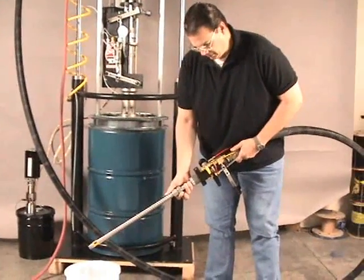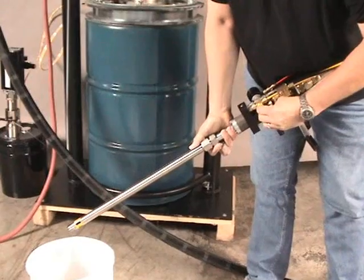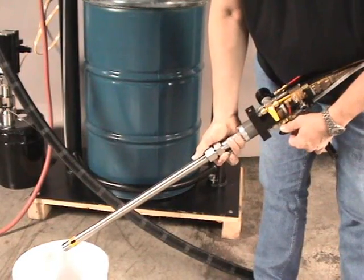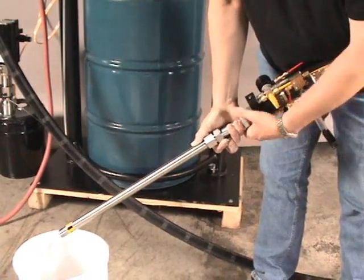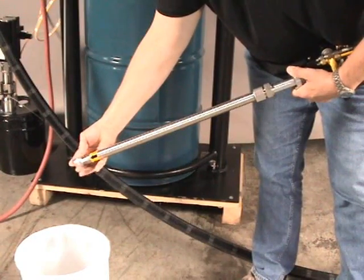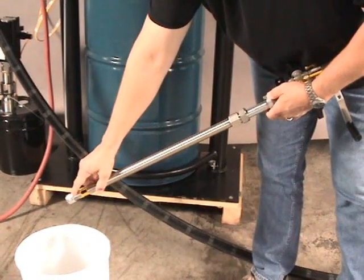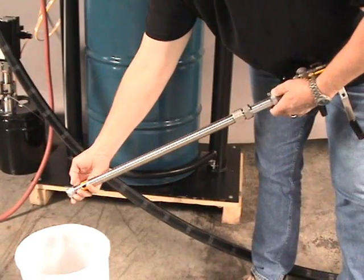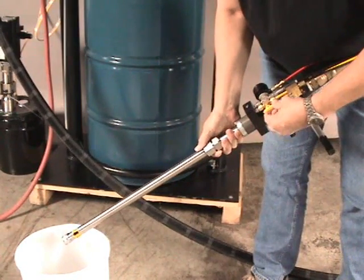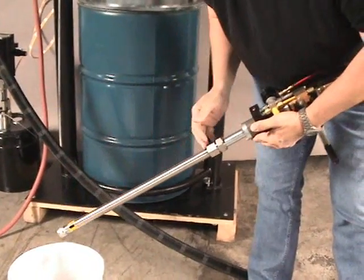For a long-term shutdown, we want to make sure that we have clean solvent exiting the mixing tube, turning that ball valve in the off position, then turn the solvent air flush valve on, purging out any excess solvent. Come down at the end, make sure the threads are clean and put a couple of turns of the nightcap. Then come back to the solvent valve, turning it on to see a little bit of solvent ooze from the thread area. Once you see that solvent exiting, screw the nightcap all the way down, come back to the solvent valve, and turn it in the off position. By doing so, you are filling this whole mixing tube with solvent for a nightly shutdown.